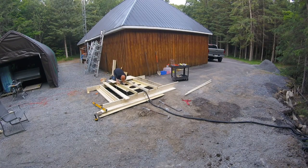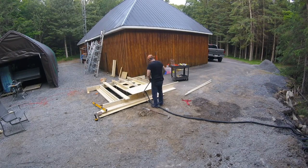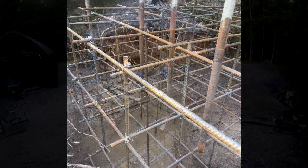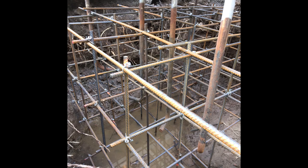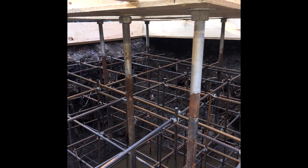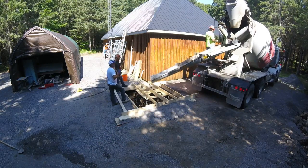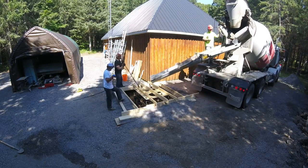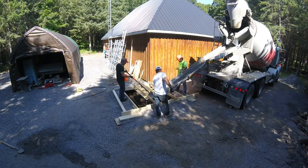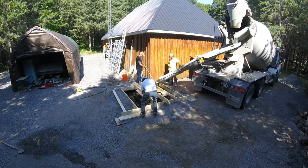There are four 36 inch by one inch and four 24 inch by one inch J-bolts going down into the lattice structure. You can see the J-bolts and the reinforcing rod lattice structure in the hole, and how they're bolted temporarily to the template. I'm going to keep that template after I've finished because I'm going to use it to mark my holes on the antenna base, and that'll ensure everything lines up properly.